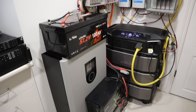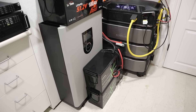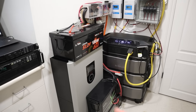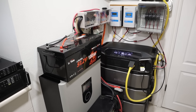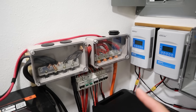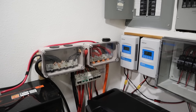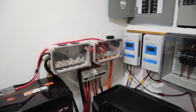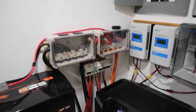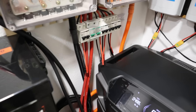Basically I have multiple batteries here: four XZNY 280 amp hour 12 volt batteries wired in series for a 48 volt battery, the Ruixu Lithium-216 which is a 16 kilowatt hour battery, and a Li-Time 100 amp hour which is a 5 kilowatt hour battery. Those are all tied together in parallel into these bus bars — the Monster bus bars from Ruixu, rated for 600 amps. Bus bars give you a place to attach all the negatives and positives to parallel everything together. The two charge controllers feed into two DC breakers to charge these batteries, and then I have two pigtails to charge power stations via adapter cables.